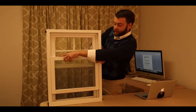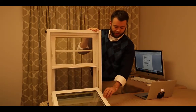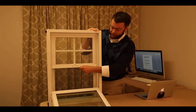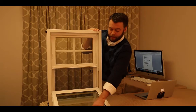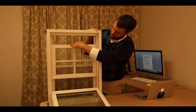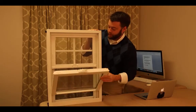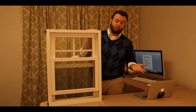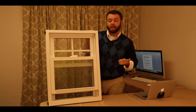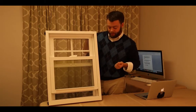Looking around the product as we tilt it in, you'll see it does what most new windows do these days — the sashes tilt in for easy cleaning. There's double weather stripping: two pieces on the side, a big bulb seal and a thin seal at the center, and two pieces on the top as well. So it's relatively well insulated. The air infiltration ratings, depending on the size, are about 0.12 to 0.15 — not remarkable, but still better than a lot of other products that cost significantly more. Ratings-wise, it's not a bad performer.